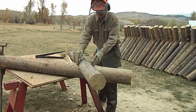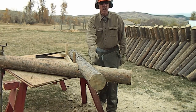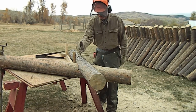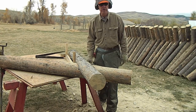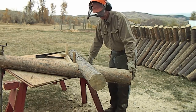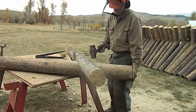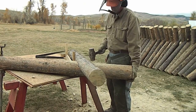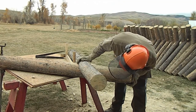Okay folks, we got that one done. We've got some pretty nice cuts there and the logs fit down pretty good. But if the logs don't sit down real good, here's a trick — sometimes you get a little bit of a wood curve in there that holds things up. Rather than going back in with the saw and widening that out, a lot of times if you just go ahead and whack that log, you can knock it down in there really nice and solid. See how that log went down right there — it's probably pretty flush, looking pretty good.